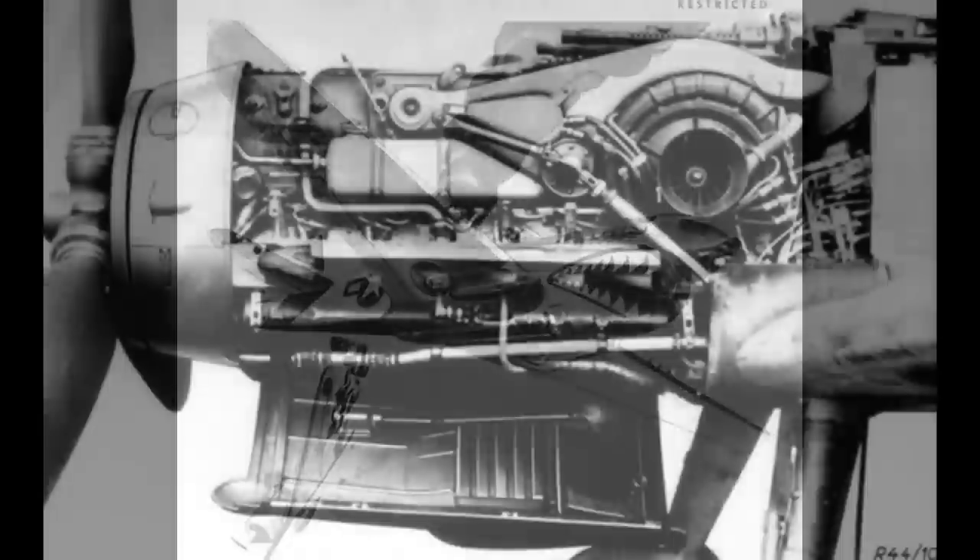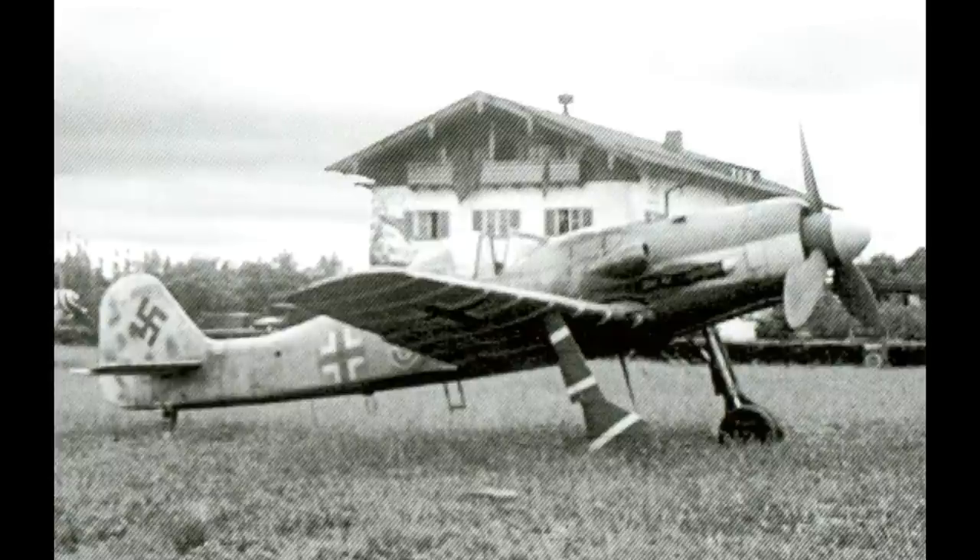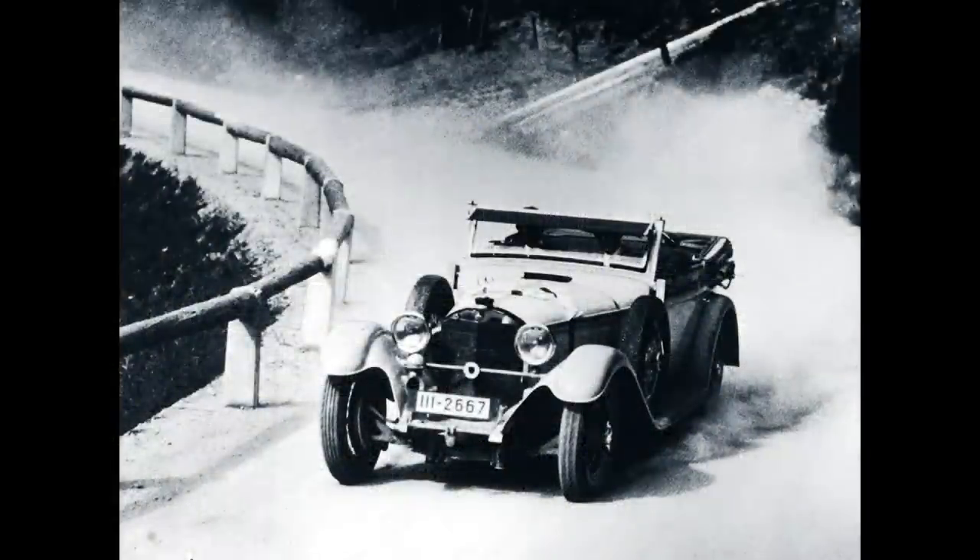Now let's look at the 109. It's set up very differently. First, you may notice that the supercharger is driven at an angle 90 degrees to the crankshaft. There are some Allied documents that suggest this was to allow space for the cannon to fire through the propeller hub, but I disagree. Nearly every supercharged German vehicle with a liquid-cooled engine designed in the 1930s or 40s had the supercharger off to the side and driven at a 90 degree angle to the crank. For example, the FW 190 Dora 9 was set up this way and it didn't have a cannon firing through the hub. Even the Mercedes SSK had the supercharger driven at a 90 degree angle — obviously it didn't have a cannon. Messerschmitt did use the available space for weaponry, but I don't think that's the actual reason the supercharger was put there in the first place.